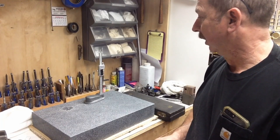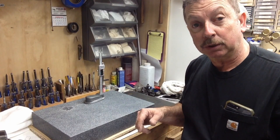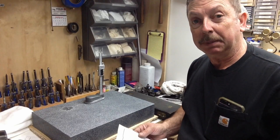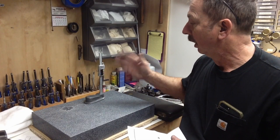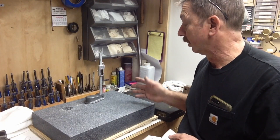There are several different options for these and I'll link a couple of them down in the description below. The reviews on these are not great just because of the machining tolerances — how accurate they are, how the base is machined, how vertical the columns are, and that type of thing. But for my application, it's not going to make any difference.